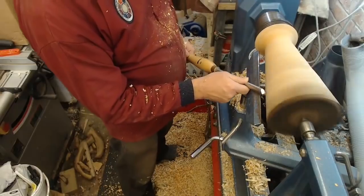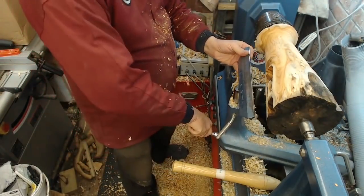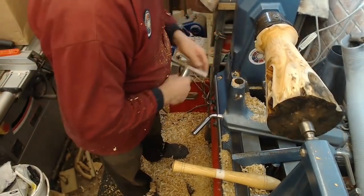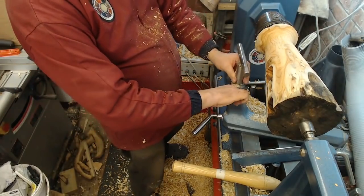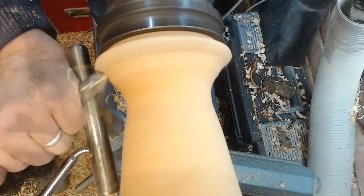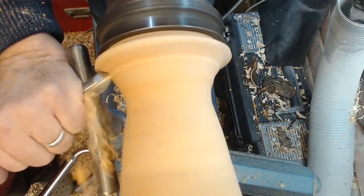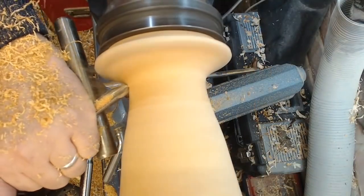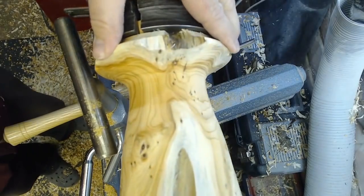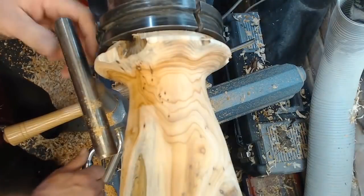The next stage of course will be hollowing, and doing some drilling to get that made a little bit easier. I've got to come down and pay some attention to this area, going in with a shorter tool rest — just tidying up the shape. Now getting the foot a little bit more refined, just thinning it down a little — it was a bit chunky. Putting a more pleasing shape there and then the transition between the foot and the base of the vase. Another thing I've got to watch out for is not to make this too narrow because I want to hollow it. There's just a little bit of torn grain there, and then I think we're ready for some sanding on the outside.